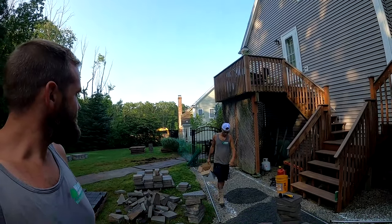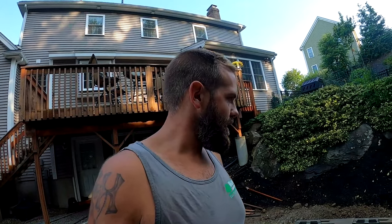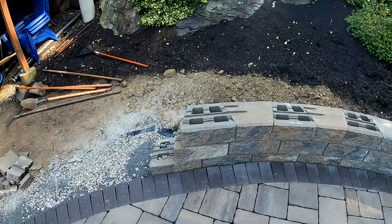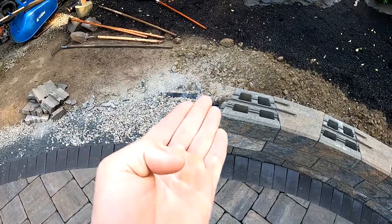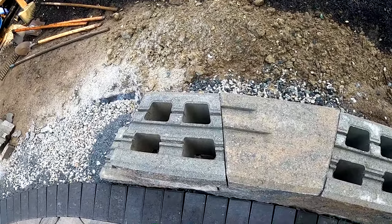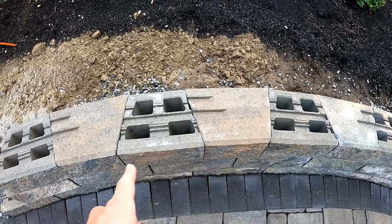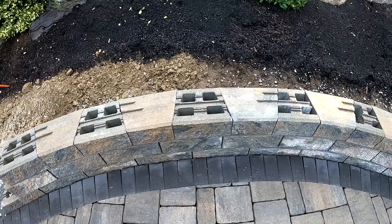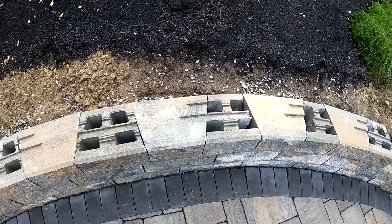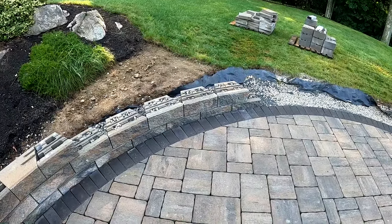Morning, everyone. I did end up putting a lot more blocks on yesterday off camera, but here's where we are. This sitting wall is going to have the corner right here, and then we're going to build it straight up to meet that third row. Here are all the cuts we made — the way this radius turned out, I could leave the full pieces uncut but cut both sides of every other hollow piece. I've probably got six or seven blocks left to get over there, and then we're making corners. Got the block splitter with us today.